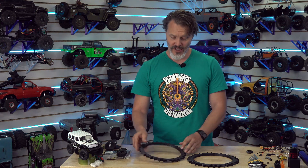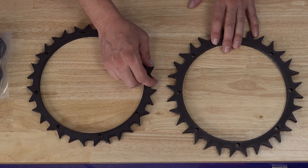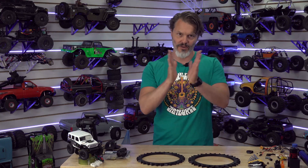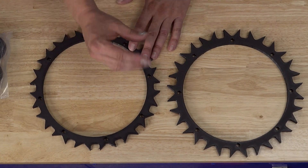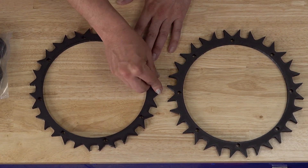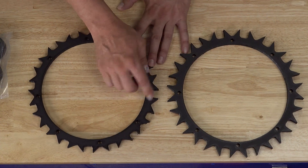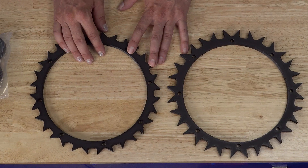And I saw that it actually works really good. As you can maybe see in the design, I have essentially a perpendicular spike edge — I'd call it 90 degrees, but it's a circle so all of the radians are going to be outwards a little bit. A set of spikes that go back to about a 45 and meet the back edge of another spike, and then we have that same pattern just repeated over and over. I added a five millimeter radius to the inside to maybe strengthen it a little bit, but also to make it look nice.